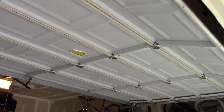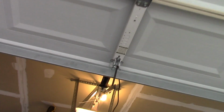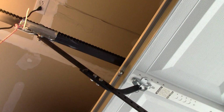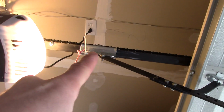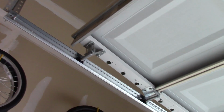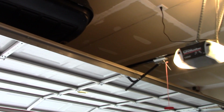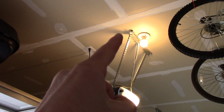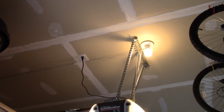So to recap, if it's making general squeaks here and there, and they're sounding like they're coming from all over the place, then it's probably your hinges and your rollers. If it's making a rattling noise, tap, tap, tapping noise, then it could be a loose chain hitting the rail. If it's making a long grinding noise, it could either be this grinding along the track, or if it seems somewhat temporary, like it comes at a certain time, then it could be that your track's out of alignment. If it's just a general loud kind of subwoofer hum that's going throughout your house, you could need to just put some bushings in there between the ceiling and those braces.